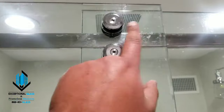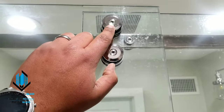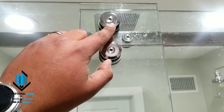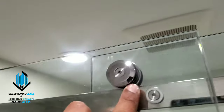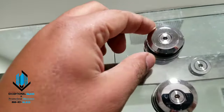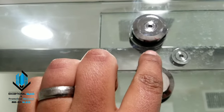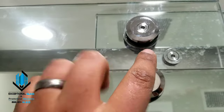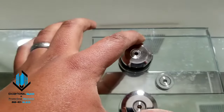This design and the Levity work the same as far as how these adjustments work — the adjustments are literally on the top rollers. When you turn it counterclockwise, you'll find a little allen key set somewhere up here. We use that as a determination: when the allen key hole is faced directly down, that means the door is maxed as high as it can go.